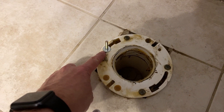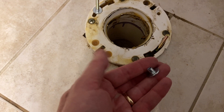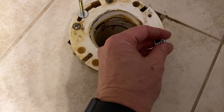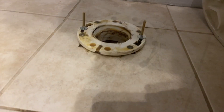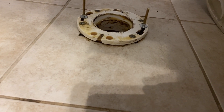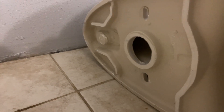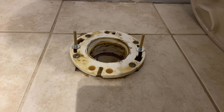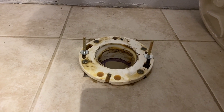Then we're going to put these toilet bolts in — they go into the flange, one on each side. They just slide in, and then there's a little cover that goes on with a little nipple that points up, and you tighten it down. Now, the plumbers put this flange in much higher than I expected, so I'm not going to use a perfect seal — I'm going to use a standard wax ring. I'm concerned the toilet and that flange may not work, so we'll use the cheap wax ring. Once you've used the perfect seal, it can't be reused, so we'll go wax ring and see how that works.